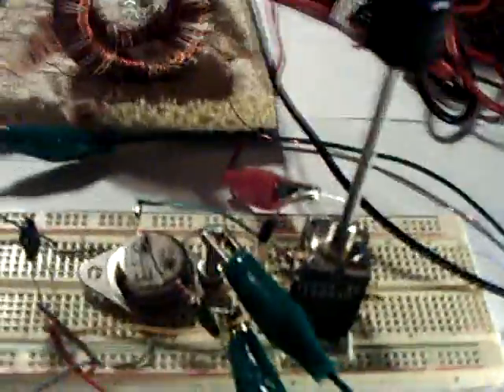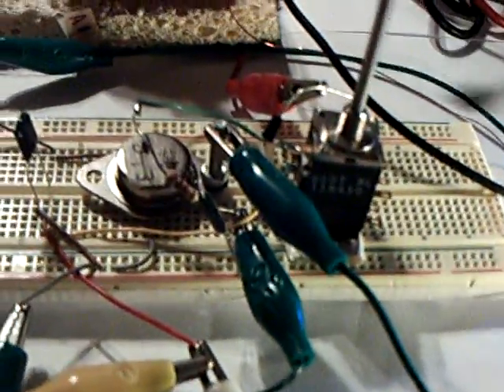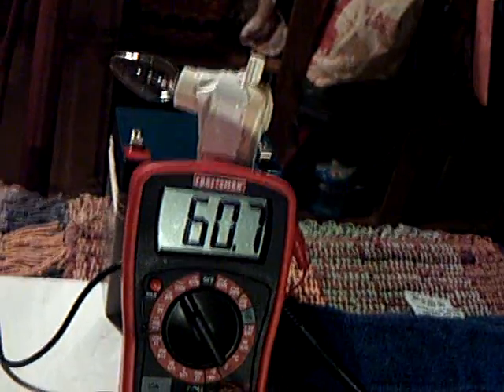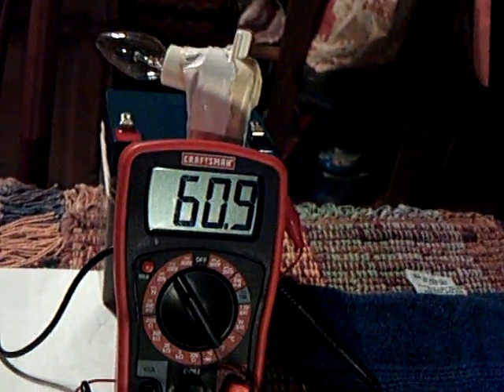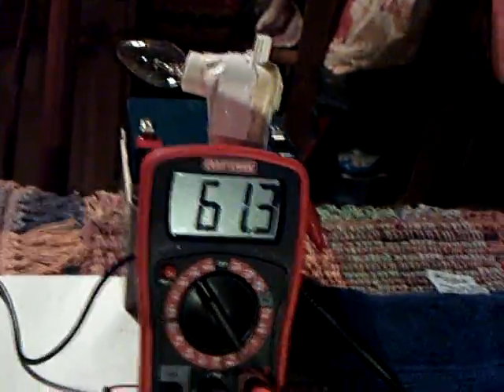The capacitor is not under load right now — it's just voltage sitting on that capacitor. It comes off of the collector right here, off of the transistor. When this coil collapses, it shoots out a spike of energy and it's captured, going backwards basically, into that big capacitor. It's about a 100-volt, 1,300 microfarad capacitor. I tried the charging part of it the other day and it works just great — not a problem whatsoever.